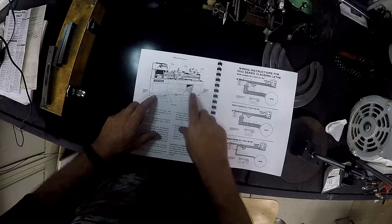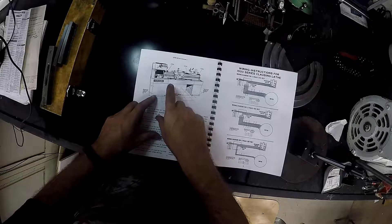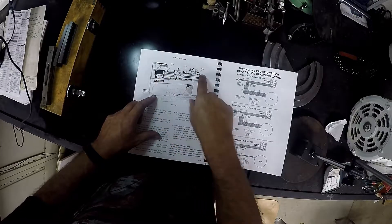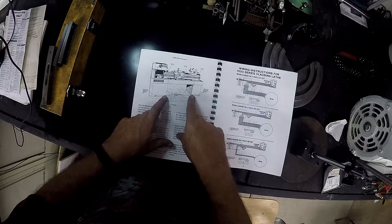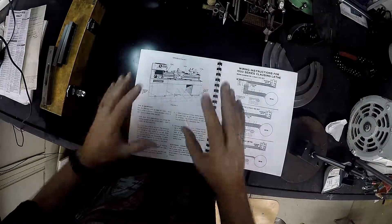The plan is I'll get the level set up and get it leveled. I've only got one machinist level, so I'll do one end and then the other, going back and forth a few times. Once I get that in place, I'll snug these down until they're just taking a little bit of load, then I'll recheck the level, make any final adjustments, and then I'll be done.